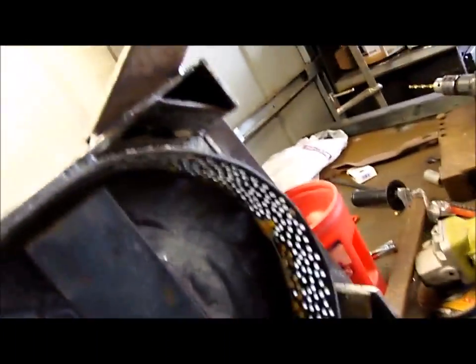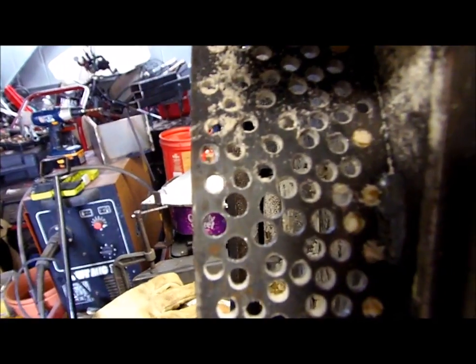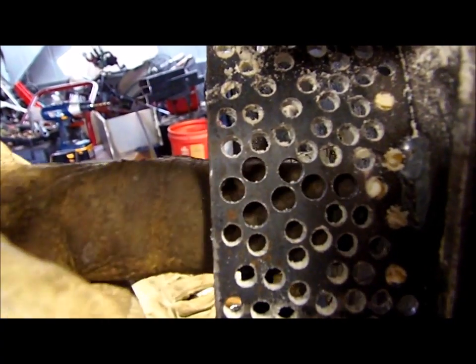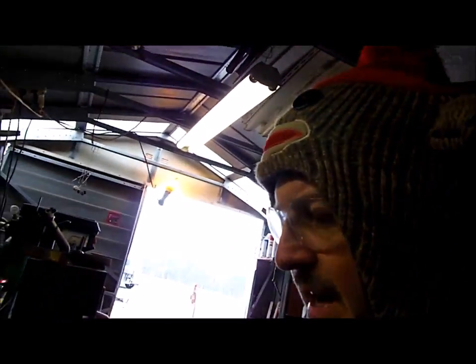The other thing I'm doing, I've just tried this out. I've got a, what size was that? 15/64 drill bit. And let's look at these holes. I've just drilled these couple of holes, the shiny ones there, you can see how much bigger they are. We might have a few spots where there's no metal between, but I'll just get over that. Yeah, that's easier to see. You can see the size difference there. And a soybean still won't go through that. So I think that'll eliminate the slowness of it coming out of the machine.